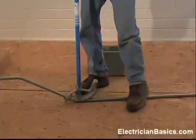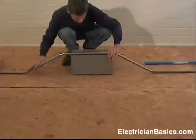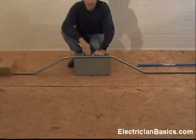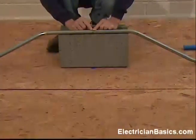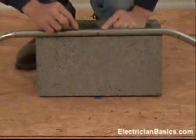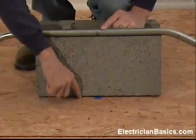Now it's time to see how well this fits against our fixed point. We place it against our fixed point, and you can see that the center mark is above the center of our bend. Here's the center mark where we've allowed for our shrinkage — we're over the center of the block. Here's the original mark, and we notice that we're about 2 inches away from the center of our block. This is why we had to allow for the shrinkage.